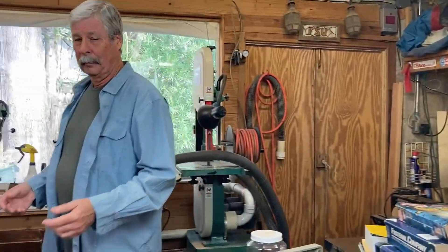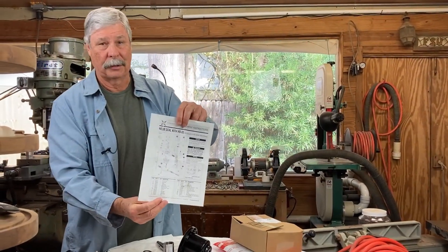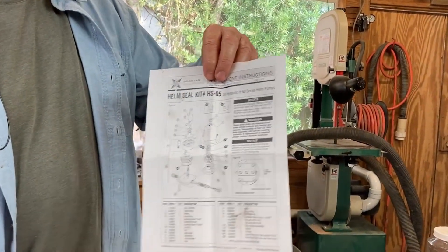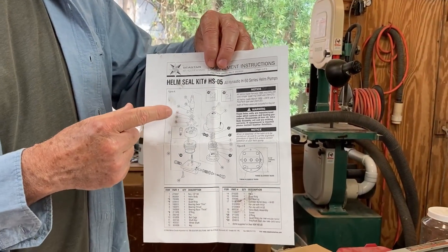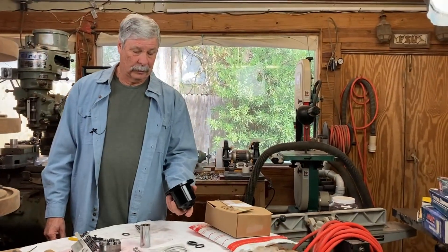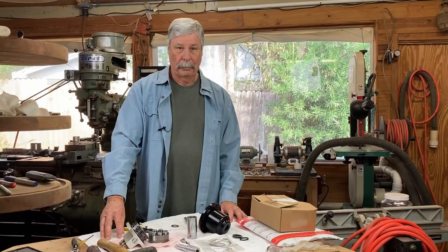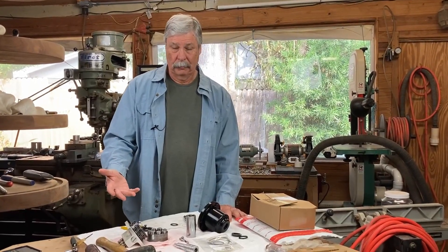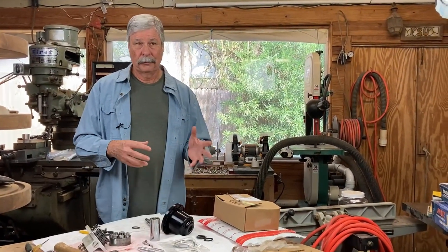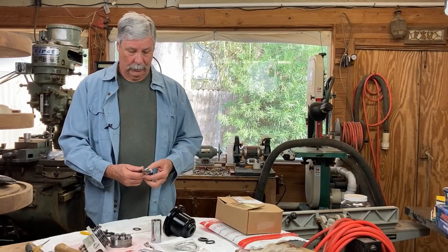So now what do I do? I luckily have a detailed parts list that includes the O-rings I bought as a kit, and it's got a snap ring with a number. The number is no good — this unit is old and it's not manufactured anymore. It does have a part number, but this company doesn't sell that part. I've looked it up on the internet and I can reference it to an automotive part number, but there are no dimensions for me to confirm it's the right one.